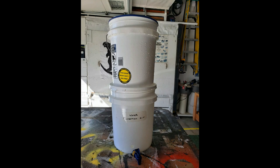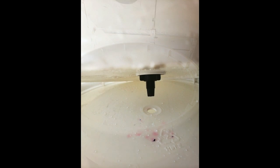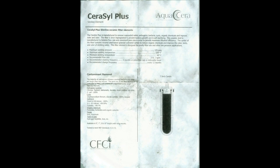Speaking of consuming water, you also want to have pre-built a gravity water treatment system. Unlike a lot of water treatment chemicals, this filter doesn't expire with age. It consists of two 5-gallon buckets, one on top of the other. The bottom bucket lid has a little hole in it, and a nipple sticking out of the bottom of the top bucket goes into that hole. That nipple is attached to a ceramic filter. Fill the top bucket up with water — the water will slowly leak through the ceramic filter, and the filtered water will wind up in the bottom bucket. This is the spec sheet on that filter.